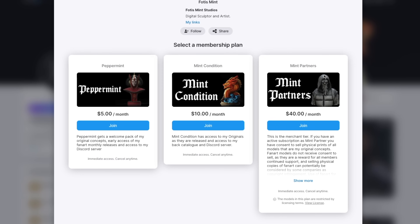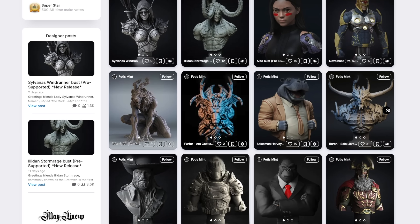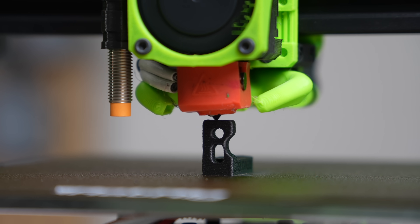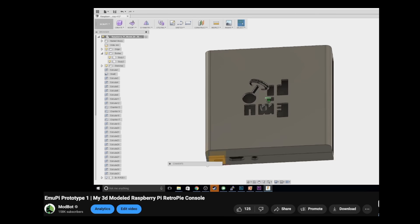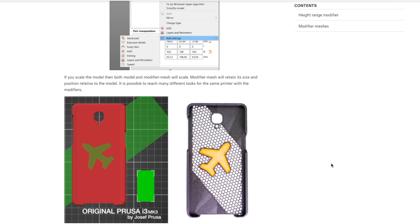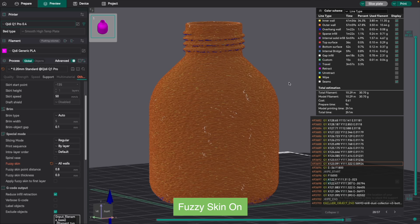What works best will largely depend on your specific niche and the type of things you want to make. For organic modeling, I'll probably always find an existing model or use an artist's work, but for a lot of what I was doing — functional parts — the 3D modeling side was relatively simple in most cases. Most of my time was spent taking digital calipers, grabbing measurements, using them for a base sketch, and extruding it into a 3D object. With the tools built into many slicers now, you can further customize models even after they've been exported to STL or 3MF.